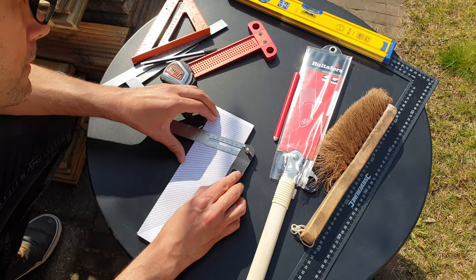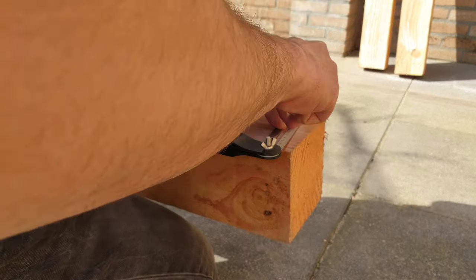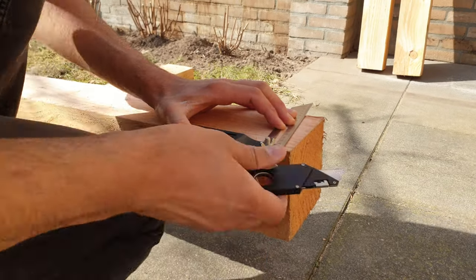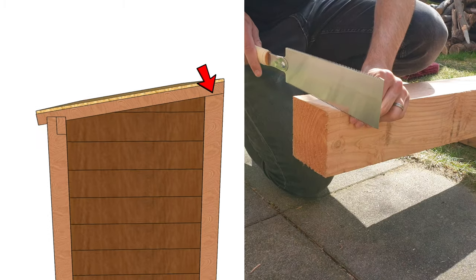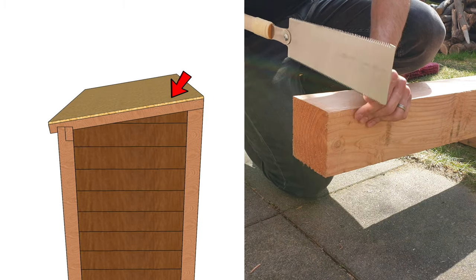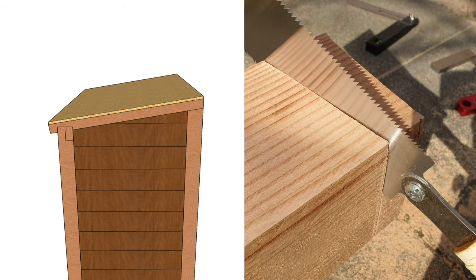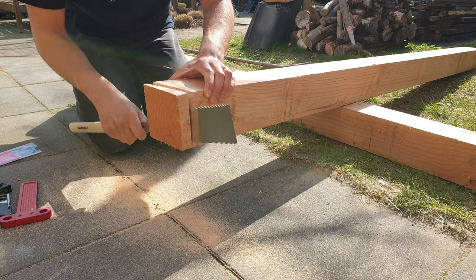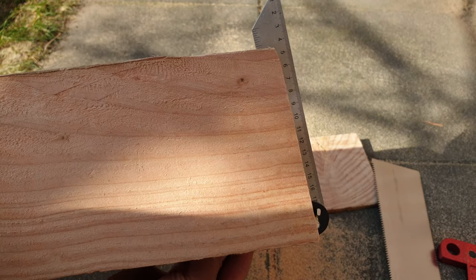When that was done I started by cutting the 9 degree angle I'm going to need for the roof. This is the minimum my roofing requires. Let me show you in the 3D model what I mean. The top of the back post gets cut to a 9 degree angle. The top bars on the side structure are angled downwards so they meet the front. At the front I can leave everything square since I'm cutting birds mouths into the rafters. I'll show you what those are later in the video.